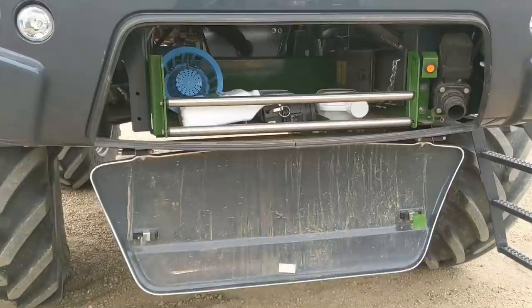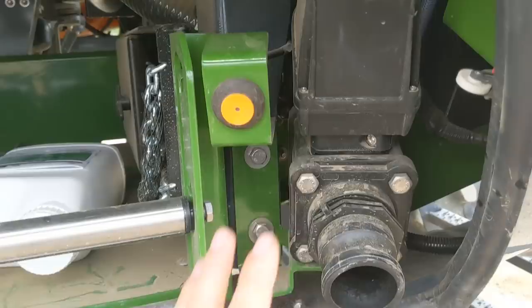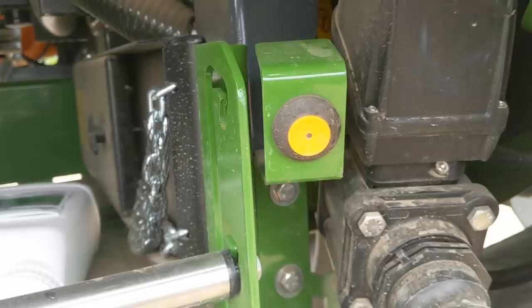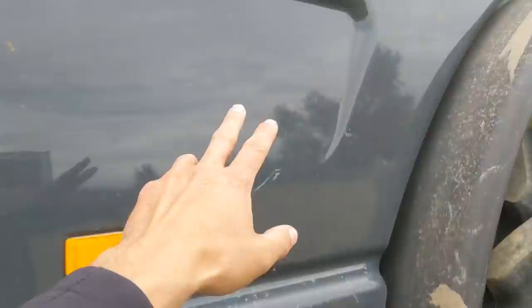That folds down. You got some handy storage in here. This is where you fill it. First of all, it's down to 2 inch. It's not super efficient. I don't really like electric ball valves, so this thing will shut off at 1,200 gallons. Not 1,210, not 1,205, but 1,200. And I'm not a big fan of that because there is no sight tube. If you want to know how much you have in it, you read off the pad right here, right? But once it hits 1,200, it's shutting that valve off, so you better have your pump turned down or bad things are about to happen.